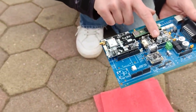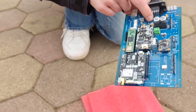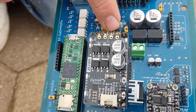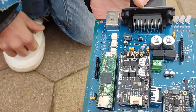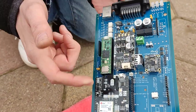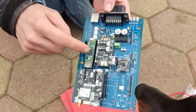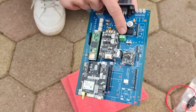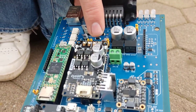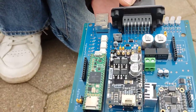The motor driver can actually work between 6 and 30 volts. To accommodate for that, you need to choose either the 12-volt input or the 24-volt input by putting a patch of solder here. If you don't solder that one, the motor won't get any electricity at all — there won't be any power sign. Once the power sign is on, you can press the two buttons to turn the motor in one direction or the other. For the 24-volt input, solder this and you're good. Or you can use this connector that comes with the board — put that connector on and power directly with no soldering.